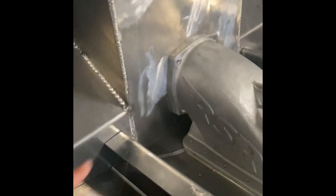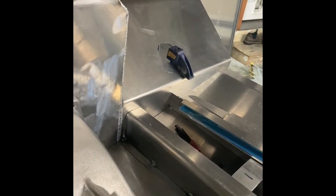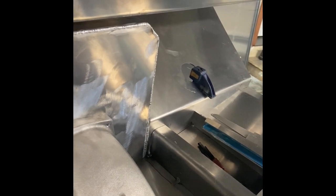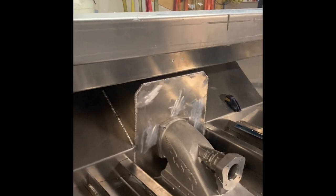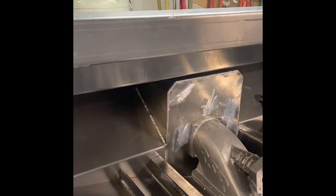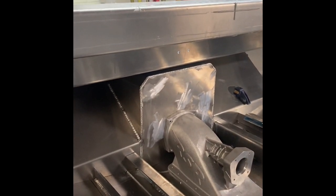This is how it's sitting at the end of day three. I got the transom all done - the transom plate in as well as the tunnel - and because of the way we put the engine bearers right up against that temporary piece, the whole transom plate goes right up against the hydro blaster and that sets the transom. It's just sitting in here right now, bolted to the hydro blaster, hasn't been tack welded yet. I've got a little bit of fit work to do to make those joints nice and tight. The transom should be fully in tomorrow and the sides are going on tomorrow - but that'll be on the next video. Please hit that subscribe button and let me know what you think in the comments!